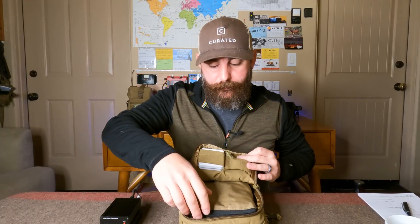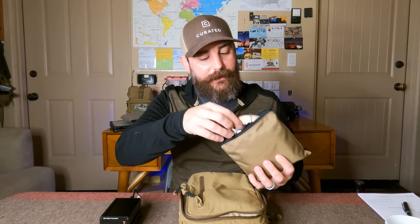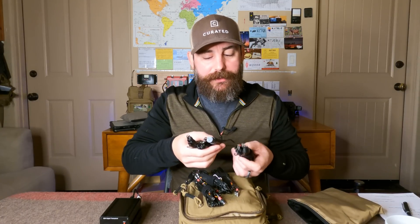For my antenna system I've opted for my personal link dipole. I'm still working on this with TIM N9SAB, but any antenna system will do. I like mine because it is fairly compact and everything stores nicely in one of the custom bags I've designed. I have a little bit of RG316 coax, and this is a five-band antenna primarily based on TIM's original 20 and 40 meter link dipole design. I worked with him to make some adjustments — this one covers 20, 40, 60, 75, and 80 meters. When paired with the QDX this will not cover 30 meters, but I think I'm okay with that.